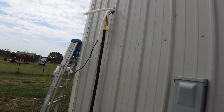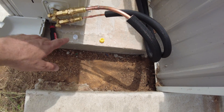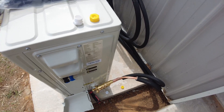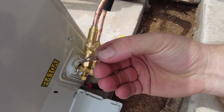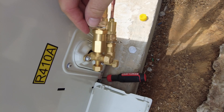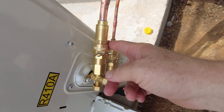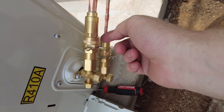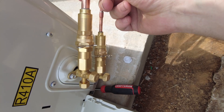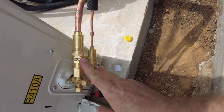We've got the smaller quarter-inch line set hooked up. When you get these screwed on, it comes with these little keeper pins that go through the connector. I think all that really does is if there's some vibration that starts to back the nut off, this will keep it from sliding all the way off and emptying your refrigerant. It goes on both of these fittings here.